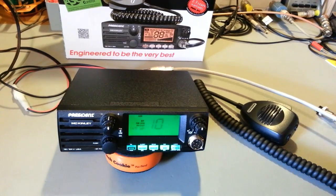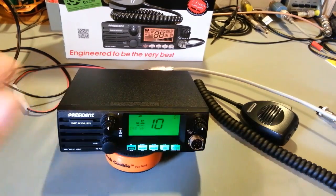Now I'm going to reach up to my antenna tuner and start to grossly mismatch the antenna. So you can see we've got an SWR of 3.8. As I go back, the beeping will get faster. When it gets perfect, 1.0, solid tone.